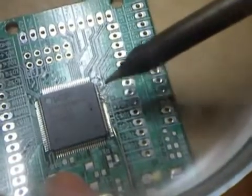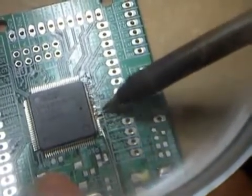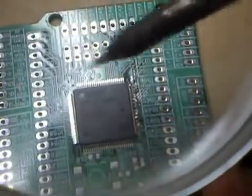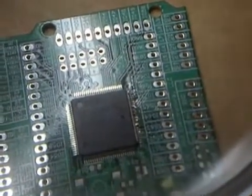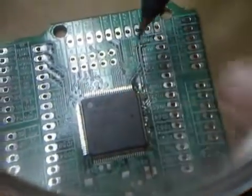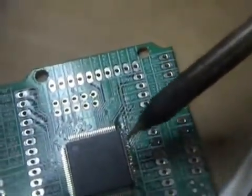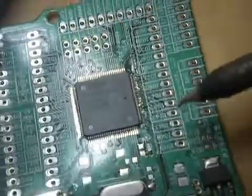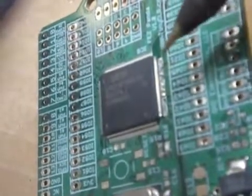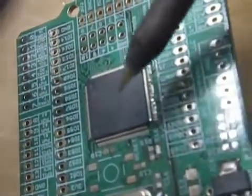I made a short here — that's okay, don't worry about it and don't try to fix it right away, just let it go. I probably have too much solder here from working across all the pins. I'll tap out the tip to make sure any excess solder is gone. Now I rotate the tip to get an angle — I don't want the tip to go straight between the pins because it can bend the pins and then you really can't fix it. You'd probably have to throw the whole board away. A slightly bent tip at the right angle works perfectly.